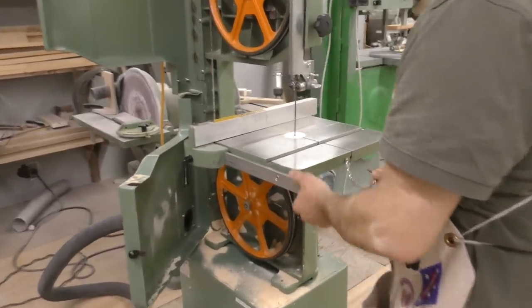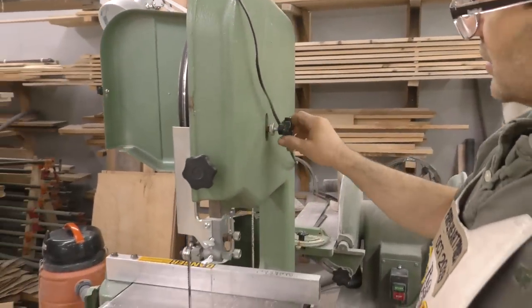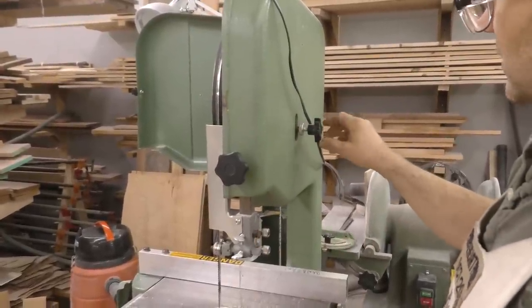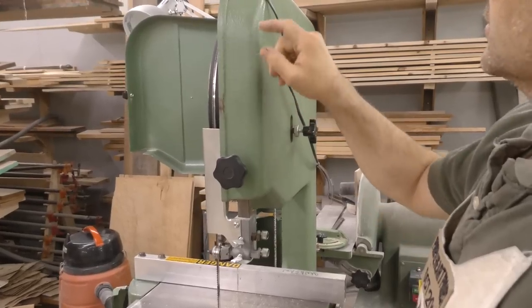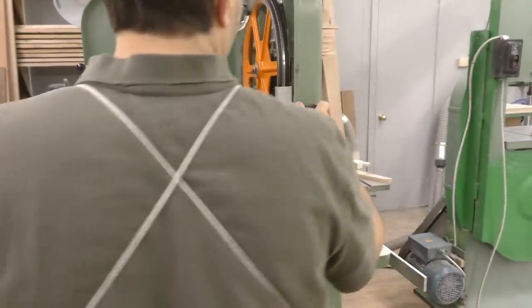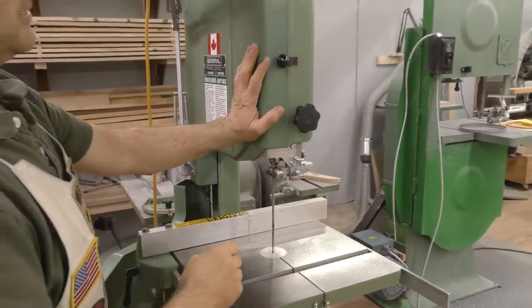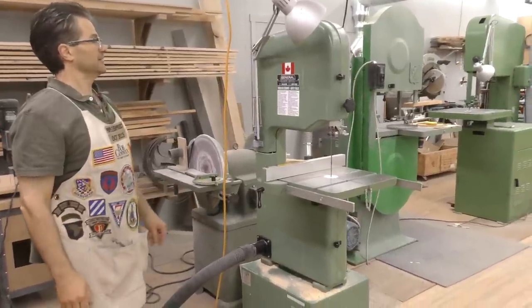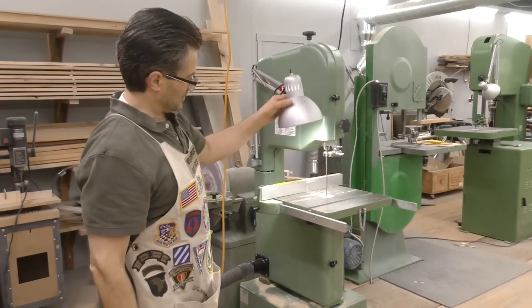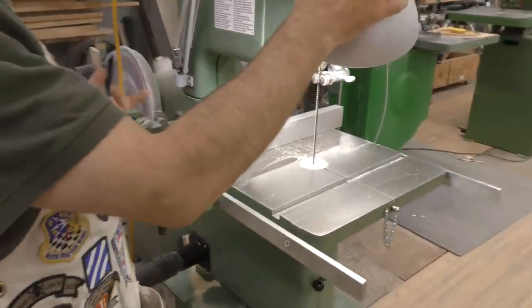Here's your pin to tie your two tables together. It's just a little bit of tape run there — slide that in and it holds everything flush. Back here, this would be a later model so they went away from those cast iron four-knob ones — they've got a plastic one on there. It's really simple: loosen, there's your locking knob, and this moves your top wheel in and out so you can adjust your tracking. Here's your means of lowering and raising your guides. We added a clip-on lamp. It's great, especially when you're trying to follow a pencil line on a dark piece of wood.